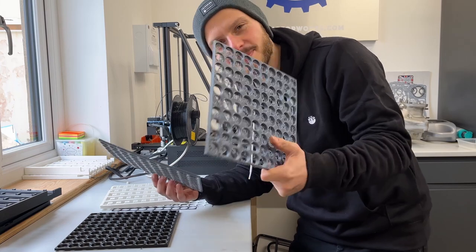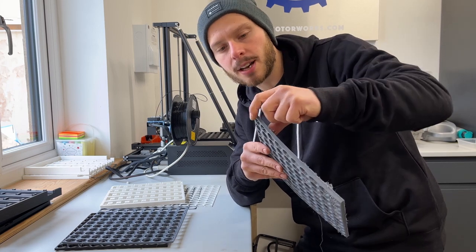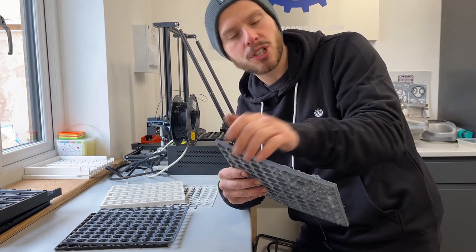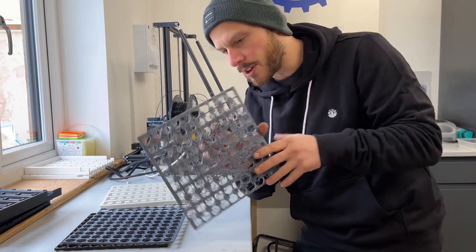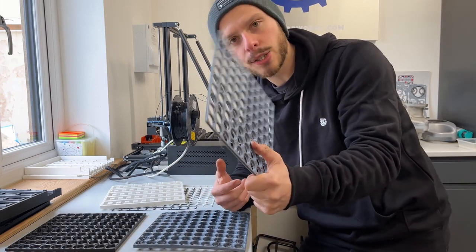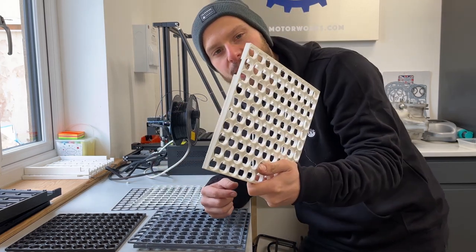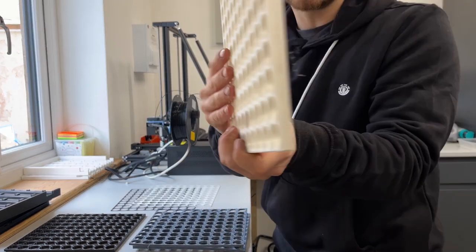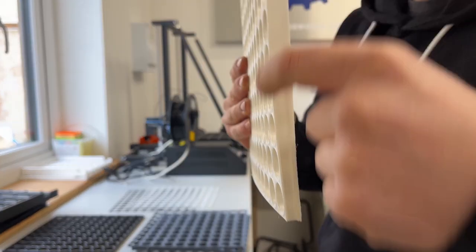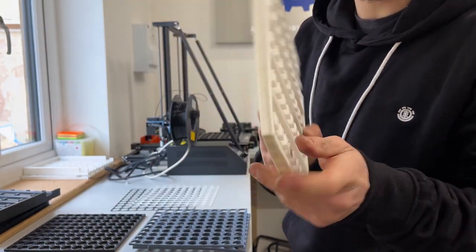It's now four days later and I've finally got all four of these printed. Let me show you what I changed for the failed attempts. I started with PETG and you can see it starts to curve on the bed — the corners lifted up and when the print head moved across it just knocked the print off. I tried to increase bed adhesion by increasing temperature and bonding, but the same thing happened. I then tried PLA and it started to wave and go thin on the corners. This causes all sorts of imperfections in size and quality because it's not quite stuck to the bed correctly.